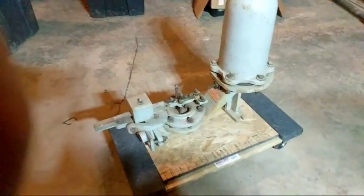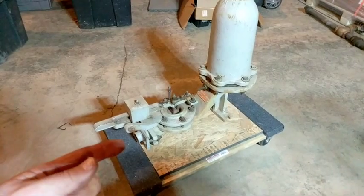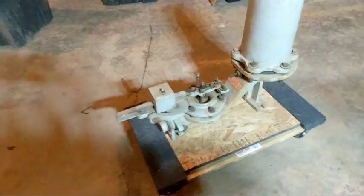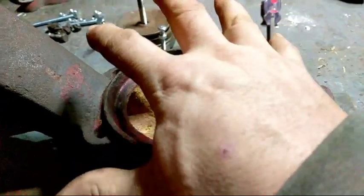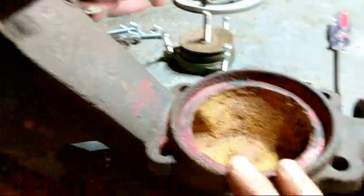And so I've got a lot of videos. If you want to actually see one running with water, just search my channel, Engineer 775, and ram pumps. The water comes in here, and the ram pump actually uses this valve. I don't know if you can see me moving this up and down. This is called the waste valve or impetus valve. I can actually show you this one because I've got it apart. Same on this ram, the water's coming in here, it wastes out of here, and I've got this completely torn apart because I wanted to get some of the scale and rust out of it.